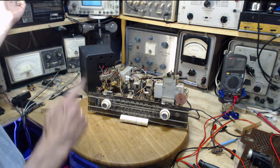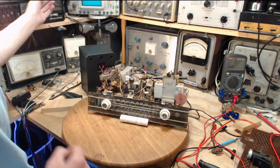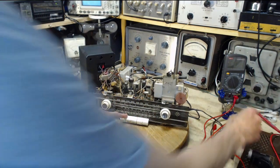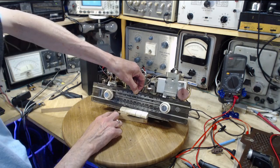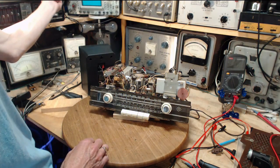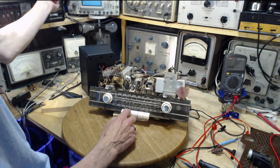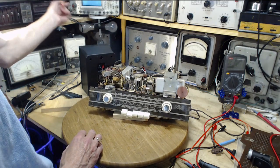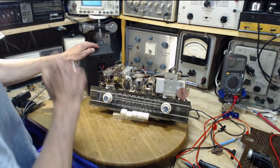Two is two done. So we're plugged in. Let me just turn off the soldering iron. And we need to lift this. There. The radio's off. Power's on with the dim bulb. Okay, power's off. AM, volume down. Power on through the bulb. The light didn't come on.